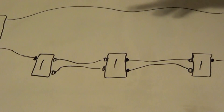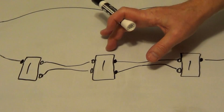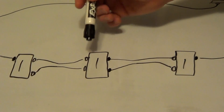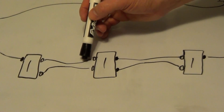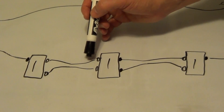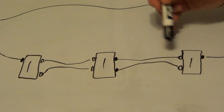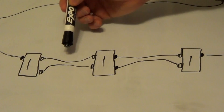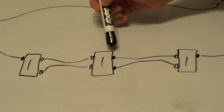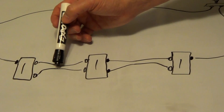The first thing you'd want to do is shut off the electricity to this circuit and remove the cover plate from the four-way switch. If you can't identify either dark-colored or light-colored screws, you can mark with masking tape the two wires coming from the first three-way switch and going on to the next. If you can't see it easily, remove the four-way switch and wires. Once you look inside the electrical box, it should be easy to see the cable coming from one three-way switch.